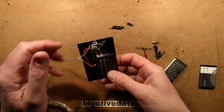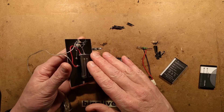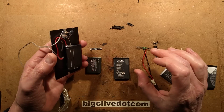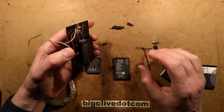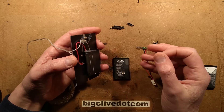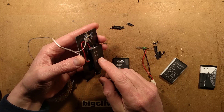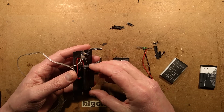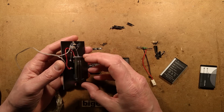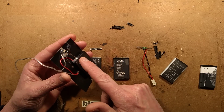When I use a battery in something like this and I solder directly onto the pads, what I'll often do the first time I use it is charge the battery from the bench power supply. I'll put a connection to the positive and a connection to the negative, and I'll set the current limit to 500 milliamps to limit the current into the battery. I'll also cap the voltage at about 4.5 volts, then monitor it. As it gets to the end, I check the current. What should happen is that when it gets to about 4.2 volts across the lithium cell inside — plus a slight drop across the protection circuitry — the 500 milliamps on the meter should suddenly just drop to zero because the protection circuitry kicks in.